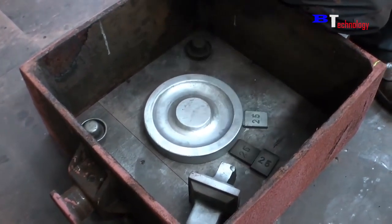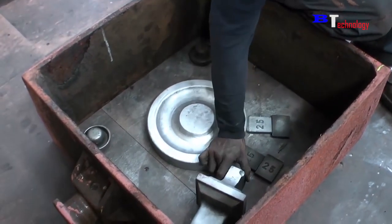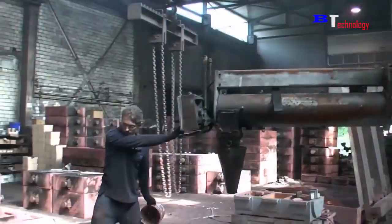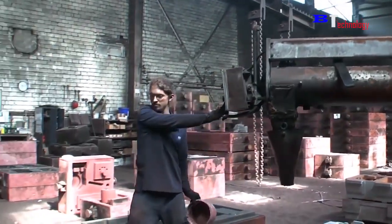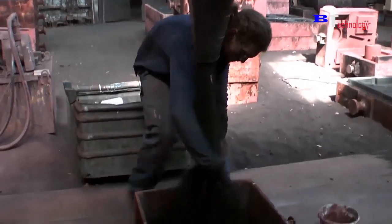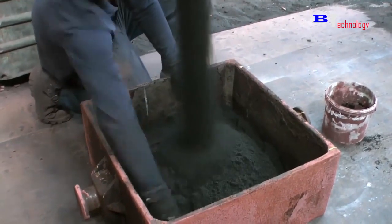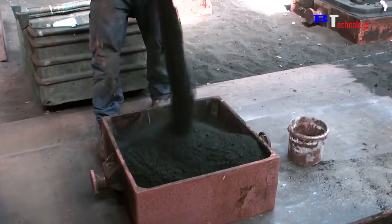The first is the molding process. An external fixed metal mold is used, which can be used repeatedly. Next, the worker places the desired device into the underside of the mold. A sanding machine will fill the mold with sand. The worker must spread the sand evenly and tightly.